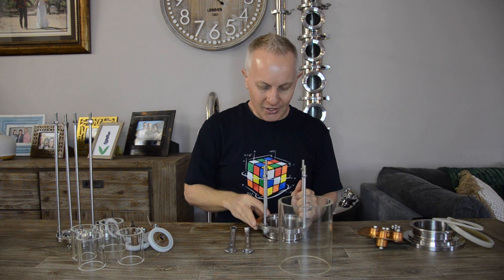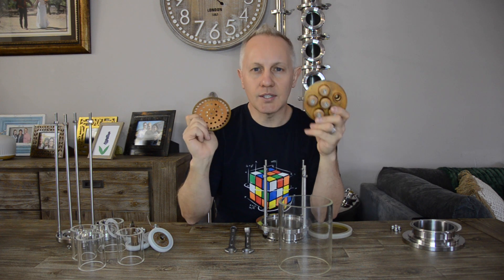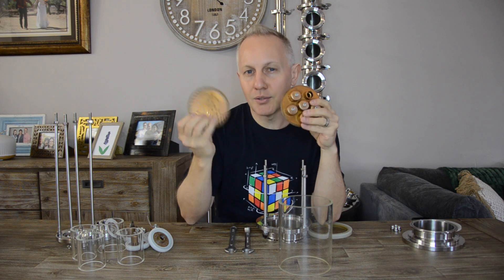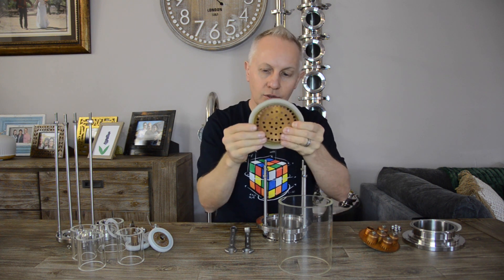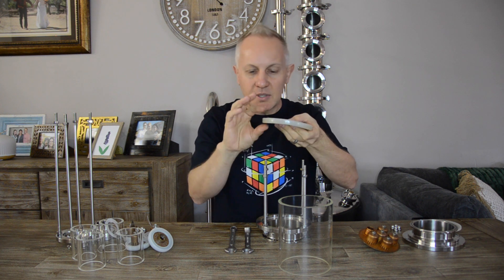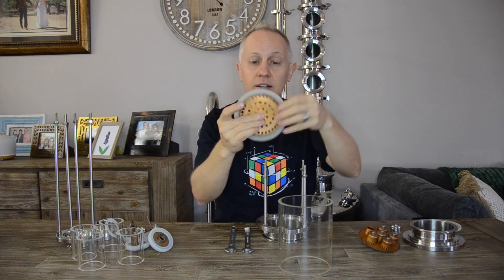First up is the 4-inch. The 4-inch is very versatile. I also use it with the 100-litre still — either with the perforated plate for ginning or the 4-inch bubble tray if I want to do something else. If you want to know more about bubble trays, go check out that video card where I explain all about bubble trays and perforated plates. Whichever one you use, make sure when you insert it into your seal, it is fully inside and not sticking out somewhere where it can cause a pinch point or squeeze and damage the seal itself.